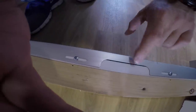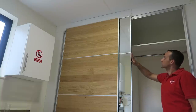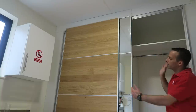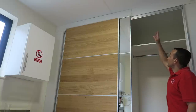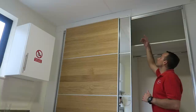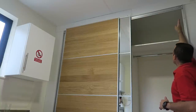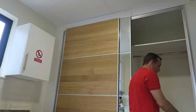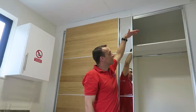This panel here is starting from the wall, so this is the ending panel here. The measurements of the main frame - just from here to the top - were not matching the measurements of the PAX doors. In this case we have the tallest PAX doors and the wider doors from the PAX range. So I have to adjust the measurements from the top to here to be exactly matching with the rails, with the hinges on the top and on the bottom. The measurements have to be very precise. This measurement from the top to the bottom - I have to match exactly in the middle and on the other side, and it has to be straight and level as well, otherwise the door will slide on its own.